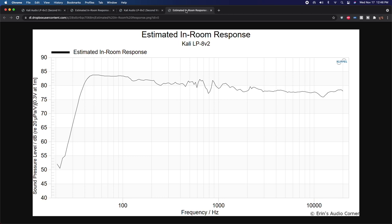On the LP8 V2's estimated in-room response, the midrange resonances are really prevalent and that's what skews the linearity. Otherwise there's a really smooth fall-off. Note that these measurements are referenced at two meters — if you sit closer, you'll get more direct sound and even more lifted treble. Room treatments, curtains, and furnishings will affect the high frequency, but you can pretty much count on matching the target curve within a few dB.